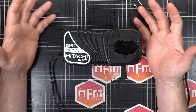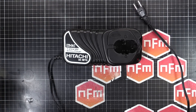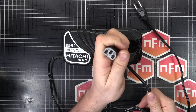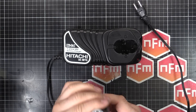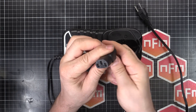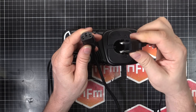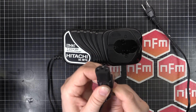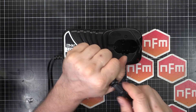If we have a 200 volt rack because we've got big equipment or a lot of servers and need more wattage, we'll use the C13/C14 plugs, which you'll recognize as this style. Those PDUs have the panel mount version of this, and we plug in our cable and into the server. Sometimes those racks are 200 volts, sometimes they're not. The C13/C14 plugs don't have a defined voltage — unlike American plugs which are always 100 or 110 volts — so without testing, you can't tell. One of the other guys used an adapter, plugged it in, and it went pop because the one he plugged into was 200 volts, not 100 volts.